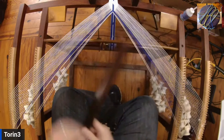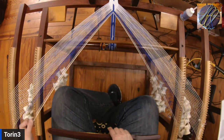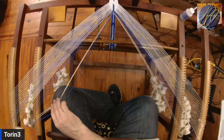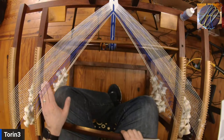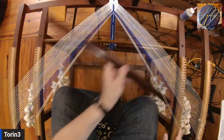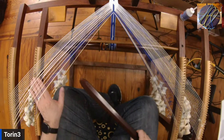I made them from 1095 steel and 15N20 — not L6. They're similar steels, but 15N20 is a bandsaw blade material. It's nice and flexible but still retains a relatively decent edge. So that with 1095 tends to produce a nice, high contrast but still easily sharpenable blade. One from the top, and then the bottom is two, three, four, five, six, seven, and eight. And one from the bottom, two, three, four, five, six, seven, and eight.